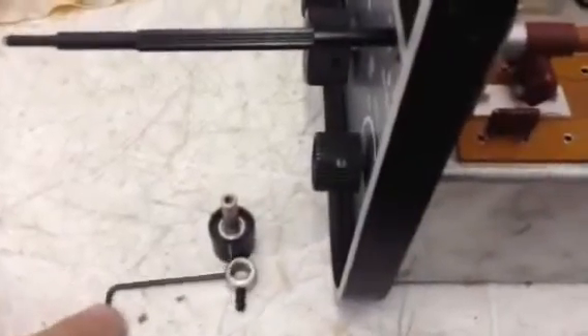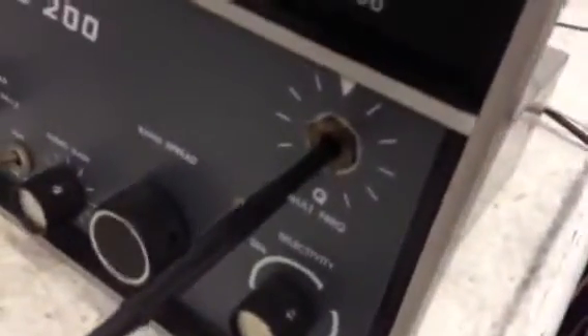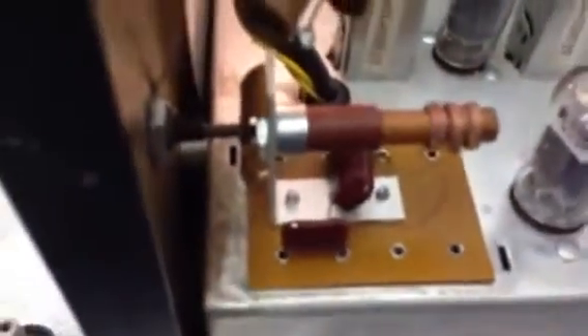I come to find out that it was indeed terribly misadjusted. I'm using a tuning tool right now because I've got to reassemble it, but as you can hear — I'll turn it up a bit — I can adjust the selectivity just fine, and I can also adjust the depth of the Q multiplier.